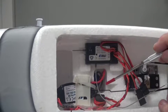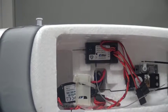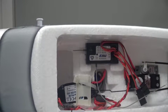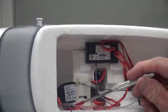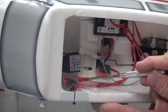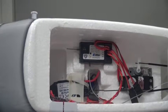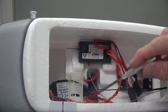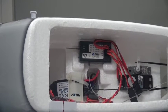There's plenty of room for the bend that goes underneath the ESC down to the nose wheel to move freely without getting knocked around. The ESC is secured and not moving around. I also added some tape here to hold that part of the switch down so it'll stay there nice and secure, and made sure the antenna was free when I put the zip tie in. Thanks for watching — stay tuned for the next video.